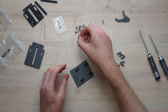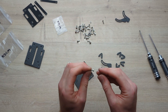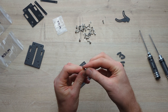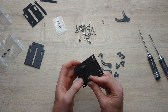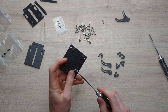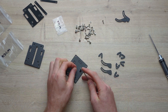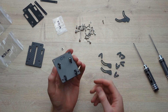The next thing is to put the press nuts in. These small nuts have little teeth on them. Take an M3 by 10 socket head screw, put a washer on it with the rounded side facing the carbon so it doesn't mark it up, then put that through, put the press nut on, and use a 2.5mm driver. Tighten that all the way, then take it out — the press nut is nicely inserted. Do the same on the other side, and that's the bottom plate finished.